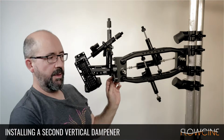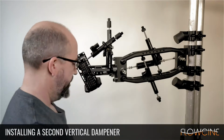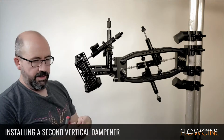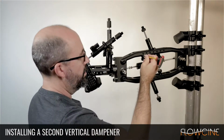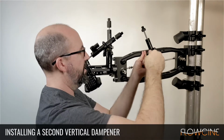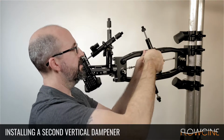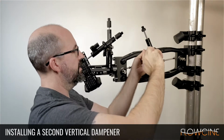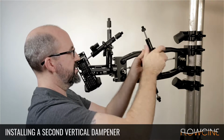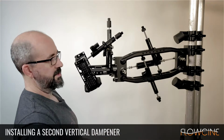So now the first holes are in position, so I'm gonna lock these. And since you're going out on the road, you always put on some thread glue. I suggest Loctite 243 for these. Makes them sit nice and tight. And it usually dries pretty fast, so.